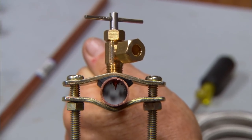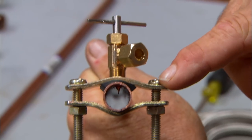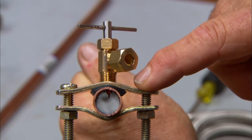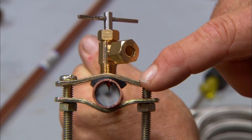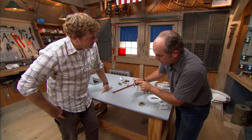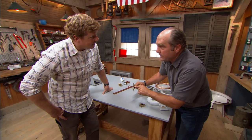But there has never been a product more designed to fail in the plumbing industry than this. Think about it - this clamp right here is not made out of brass. It's just simple white metal with a coating on it. That's going to rust someday, and when it does, this will leak all over the place. It also has just a little gasket right here that is trying to hold back city water pressure. That's going to fail someday.